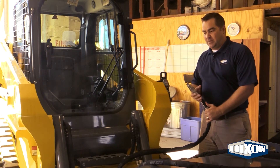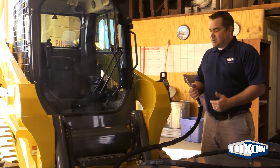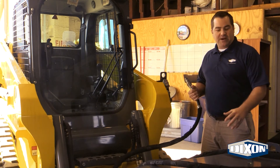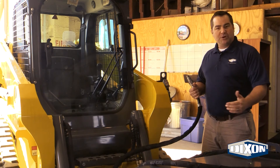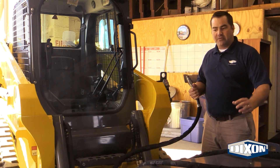We've just been running the piece of equipment and we're getting ready to come in and attach our broom. Typically what we see out in the field is that when the customer has a piece of equipment out there, if they're going from a broom to a bush hog, there's going to be thermal expansion and pressure build up in the feed and return line on the attachment.